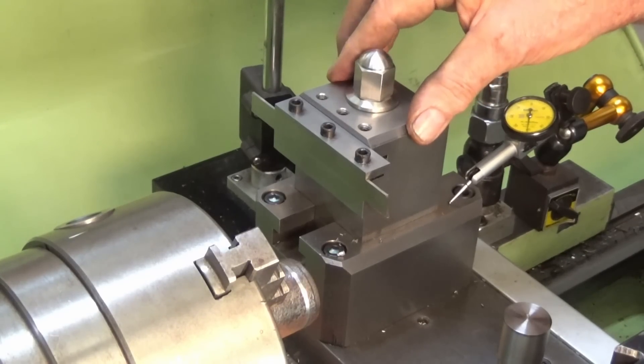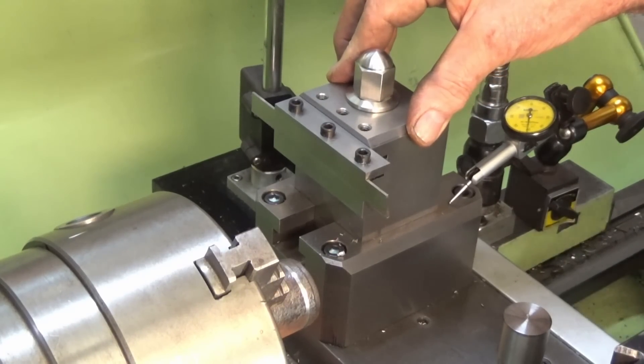Even the inverted style of parting tool blade that I was using in the front tool post gave me problems, but this so far has proved to be way, way better. I can now power feed this screw stock and I haven't yet had an issue with it catching or digging in or breaking a blade.